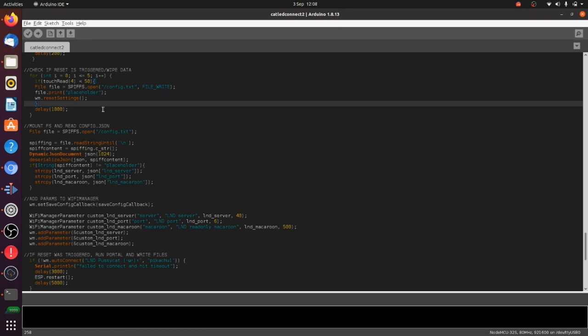There's also a touch pin. ESP32s have something called a capacitive pin, which means it can sense a capacitance change. We can add a jumper lead to pin 4, and then for the first few seconds while the device is turning on, if we hold and press that jumper lead it will drop the capacitance. That acts as a button which will also trigger the portal — pretty cool.